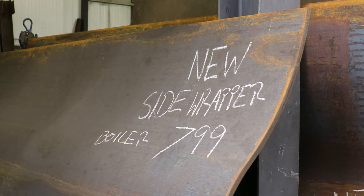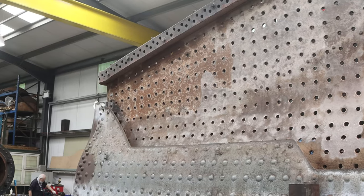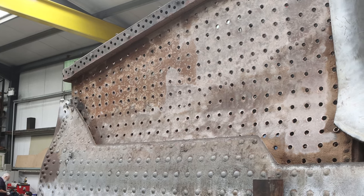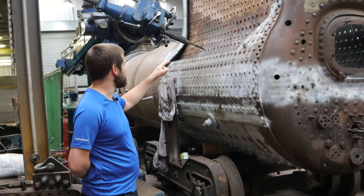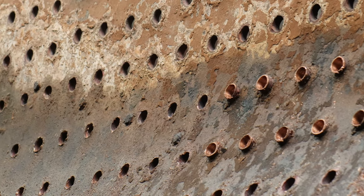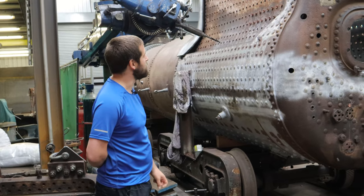While we've been looking at the plate work, the Urie guys on the weekends have finished off drilling the remains of all the stays, and you can see there are no stays left in those holes now. Those holes are ready for reaming and tapping through once we get all the outer plate work welded back on. The guys have finished drilling all the stays out this side as well — there are just a few stubs to chuck out with the chisels.